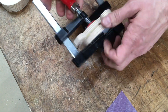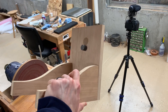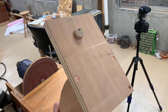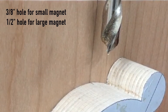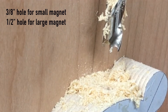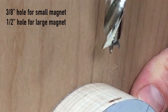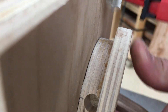Next I drill holes for the magnets in both the base and the top switch using a 90-degree jig with plugs for either side. The wood plug is better than the metal one because you can drill all the way through without cleanup at the bottom. After drilling one hole, rotate to the next mark and drill another until you have six evenly spaced holes all the way around the workpiece. It's the same operation for the glued-up base and mount.